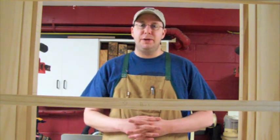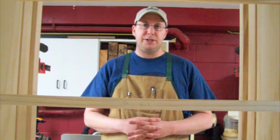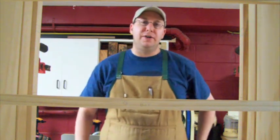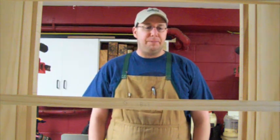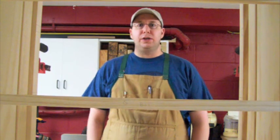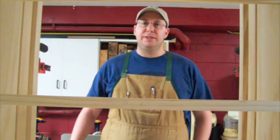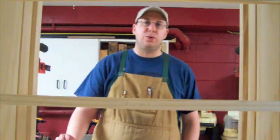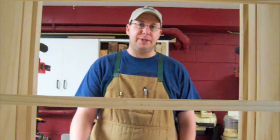It's a very basic construction so I'm not going to show you step by step on this project. I've got a couple of things like the dovetail sockets on the top that join the top rails — I'll show you those in detail. The carcass is pretty much built with four corner posts, each a two-inch square piece, with tapered legs on the bottom, and I'll go into detail on how I did the tapers.